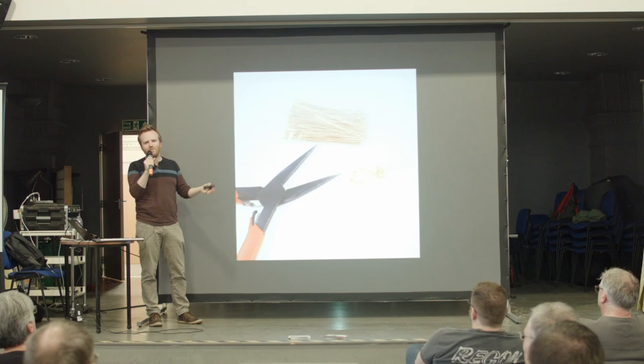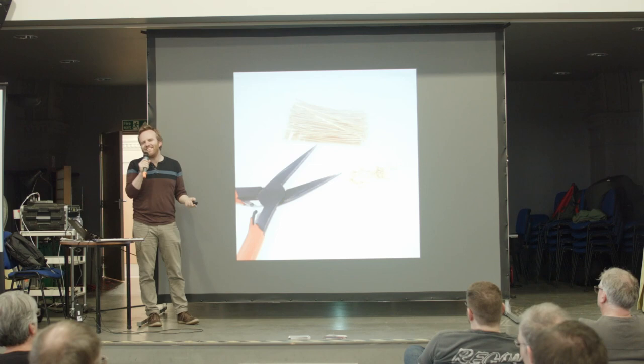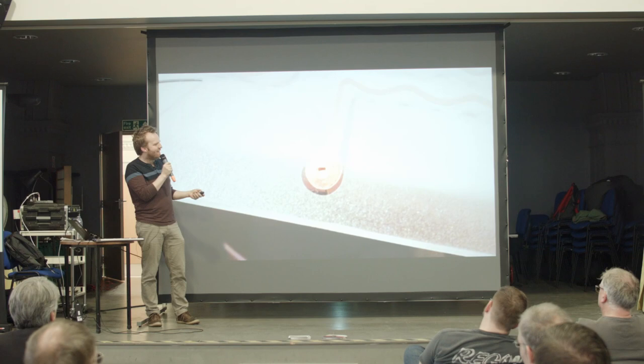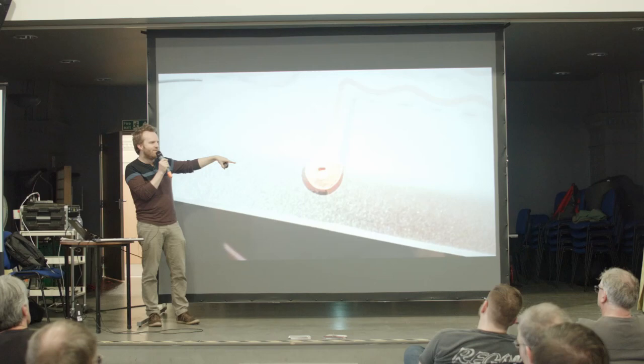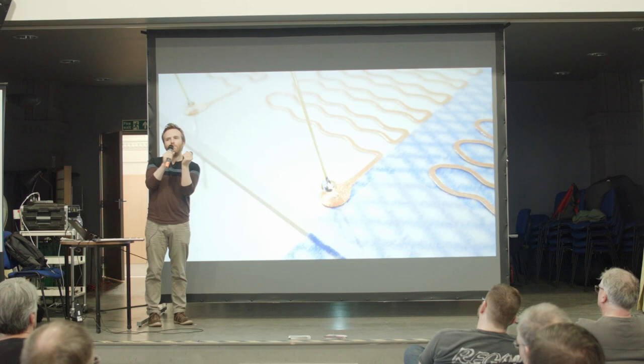Second, of course, there were like two bead shops in Brighton, and one of which was like 100 meters away from where I was. So I went and bought these copper pins, which were perfect, and then some copper sequins. The copper pins were slightly recessed, sort of clung onto the foil really well, I soldered that, and then from underneath, I put one of those sequins and soldered it on the bottom as well. So it was really locked in, so you could pull that pin around from underneath and it wouldn't damage the foil. So much geeky detail.